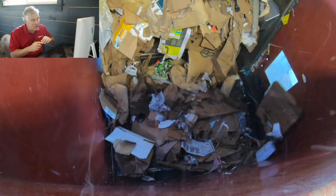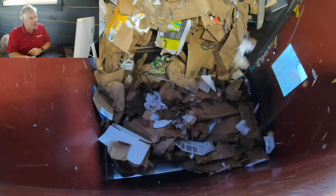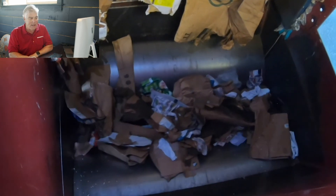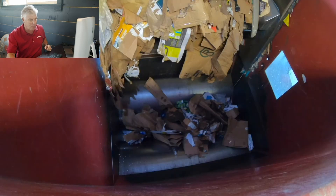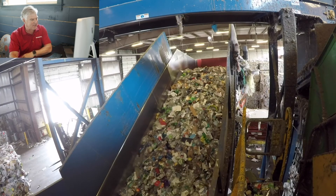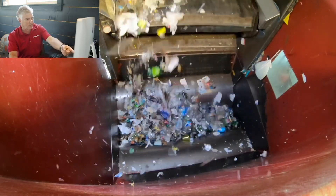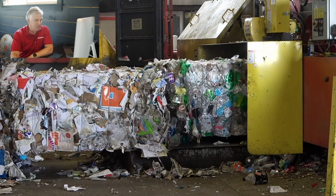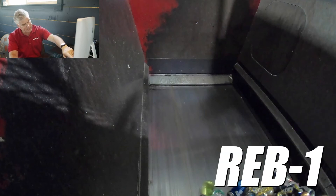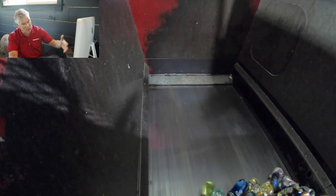You're getting 92 percent above the knife again — reiterating the point because you've got 26 inches above the knife by 90 inches by 60 inches wide, that's 92 percent more material. Let's see how much gets into the box — maybe 88 percent on that one. Watch full speed: a whole lot less vibration. Here's some plastics — look at that, no rollback, more productivity. Here's UBCs in a REV1 — you can see the UBCs getting on top, and in a REV4 none of that would have happened.